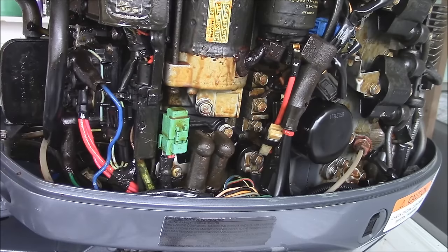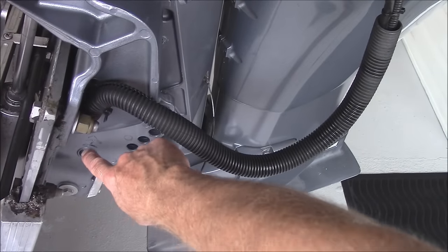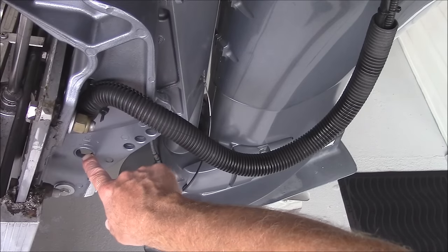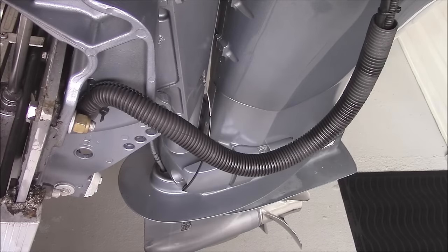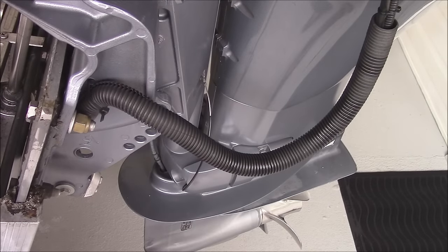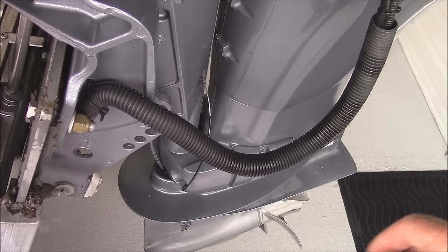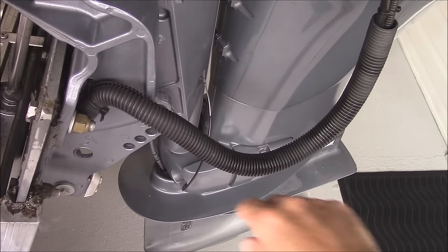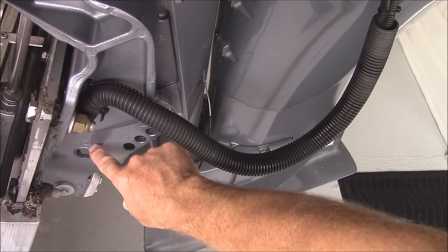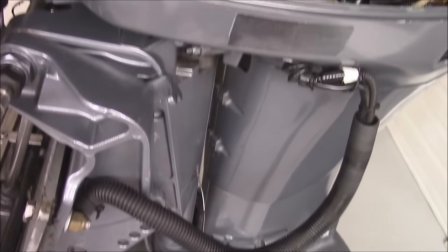When I climbed down to lower it, it didn't want to lower. Down here there's a little screw hole with a flat head, and you can put your screwdriver in there and manually release the pressure to lower it — almost like on your floor jack, where you twist the handle and the jack lowers. In an emergency situation, you can see there's a little emblem right there that looks like the engine's tilted. You can always do that to get it back down if you absolutely had to.